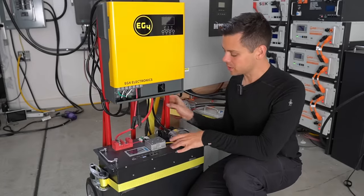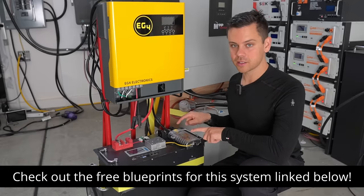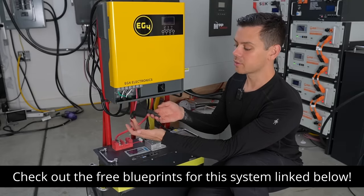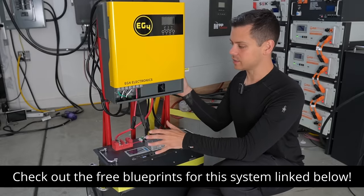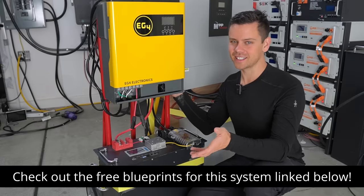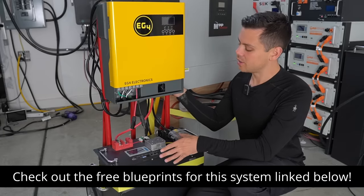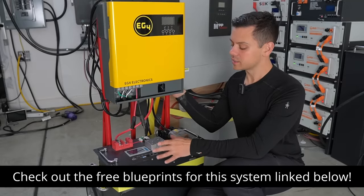Now for this system I did some upgrades. We have a converter circuit that takes the 48 volts and converts it to 12 volts, and it supplies a 12 volt fuse block. Over here I added some MC4 extension cables so I can connect my own solar array — anything from 120 volts to 500 volts. I love this thing; this is a fantastic size. It's easy to move around and I actually got to test it. Some guys working on my air conditioner needed an extension cord for like three or four hours, so I just wheeled this out and they used it the whole time with multiple tools without a single issue.